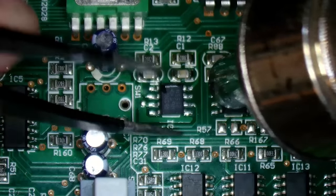Well, just seeing if I can poke around and provoke something to happen. Oh, hang on. Is it this pot here? It is the balance or the pan pot. Well, look at that, wiggles on and off. Like a switch. It's not this capacitor, is it? No, there's something. It doesn't even like that. Mute. Lights. It's sort of affected a bit. There's something round here. There's not a lot underneath this board as we saw.